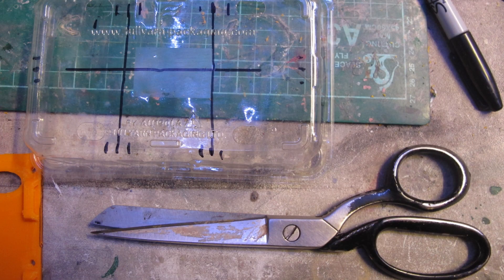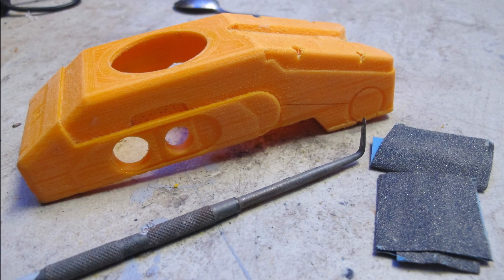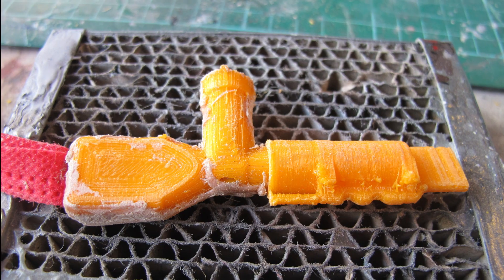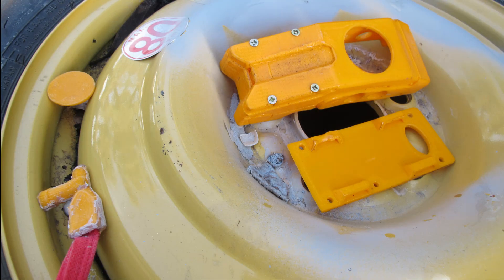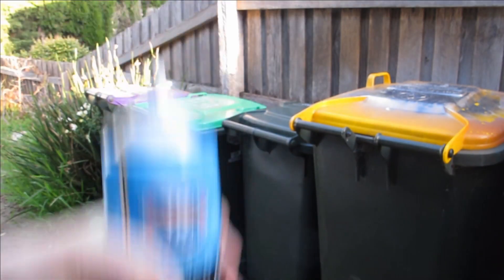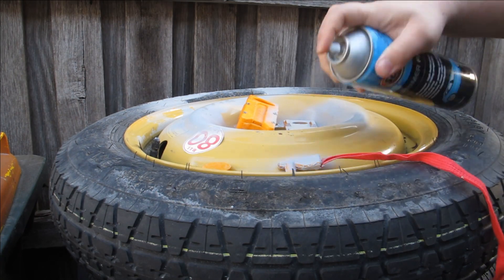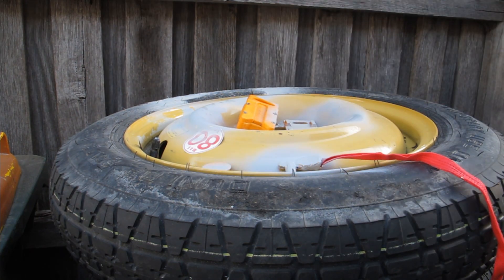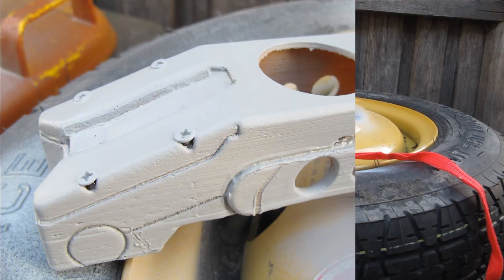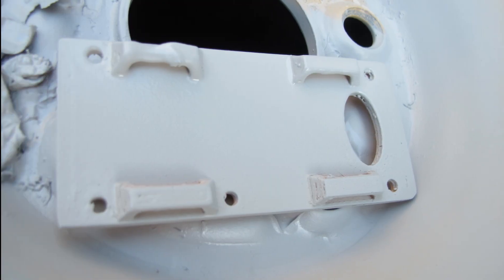Assembly has started. Large pieces I like to glue together with contact adhesive, smaller parts with superglue. This one needs to be assembled and put back together for the inclusion of parts inside — there's a bit of multimedia with a coil, some wires, and a clear component for the light to go through, made out of food packaging. The problem with FDM additive 3D printing is, no matter how good your machine is and how perfect the print is, the artifacts will be seen regardless. Hand tools and time need to be invested, and with the right grits of sandpaper and using a reamer for any join holes, you get more efficient the more you do it.